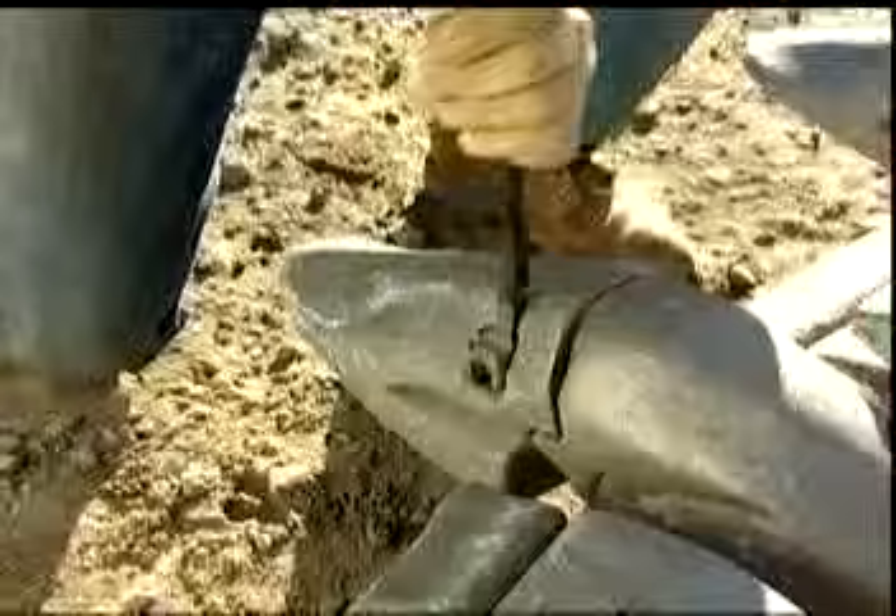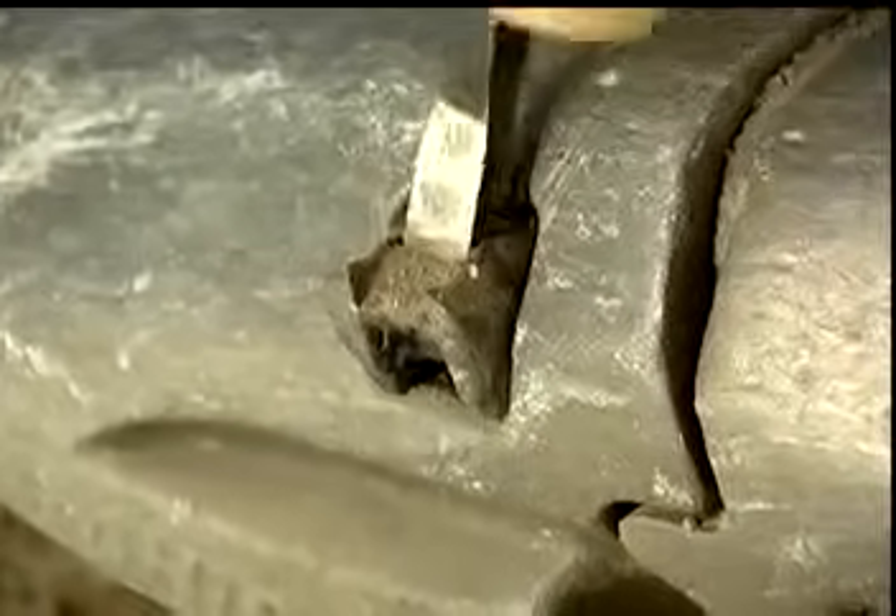Clean the fines from the second groove. Reinsert the pry bar into the second groove and push the pry bar handle toward the center again until all three grooves are showing. In certain applications, the third groove may be beneficial in reaching the fully unlatched position.